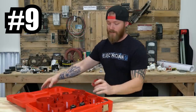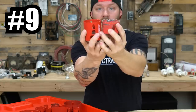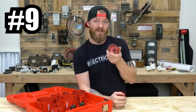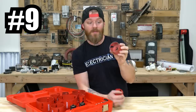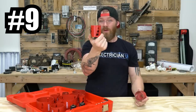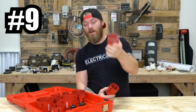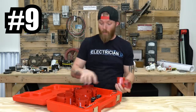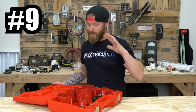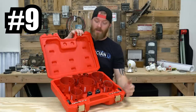The Diablo ones are sharp — they're meant for wood, some thin metal, nothing stainless. But this other one doesn't have any sharp teeth at all — it's completely flat, but it's diamond. So if you're cutting through Hardie board siding, a roof soffit, or some kind of concrete-like material, use a diamond bit because it's actually designed for that. It keeps material buildup out and keeps the heat down. Don't drill at high speeds, drill at low speeds. In my experience, you damage the teeth on regular hole saws really quickly when trying to cut Hardie, so just don't do that — get something like this. I know these bits aren't cheap, sometimes $30 each, but it's a really good thing to have. Electricians use hole saws constantly.